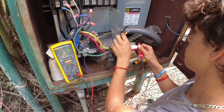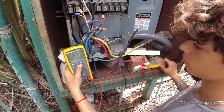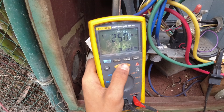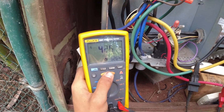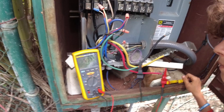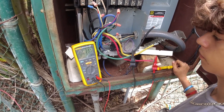This well is not very deep, so 10 seconds is plenty of time to charge everything up and get a good reading. A deeper well we'd hold it for a lot longer. Go ahead and hold it down: two, three, four, five, six, seven, eight, nine, ten. All lines are about 540 megaohms.